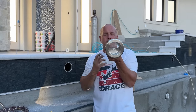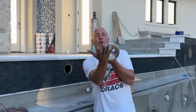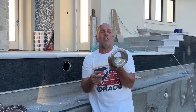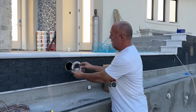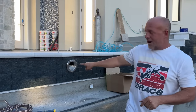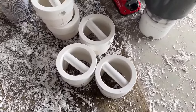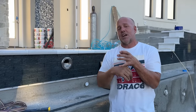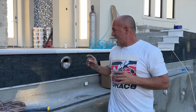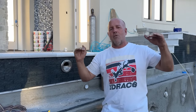So it's a perfect skimmer because I'm taking water from a different source, overfilling the pool through the jets, waterfalls, anything I might have running. It will spill over the top. Once it spills over the top, it will go into that secondary skimmer source, which has got an adjustable level part that I made with a handle. I can pull it out, and the handle through the middle is just to keep big objects from going down the pipe system. Anything that can get through the adjustable water level, I can fix once I decide where I want my water exactly.